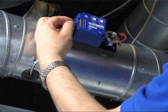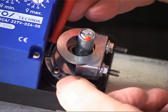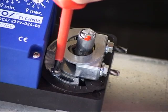When it is open — this can be identified in most units when the slot in the damper shaft is standing horizontal — the 24V must be switched off immediately. In this position, the rotation angle limiter of the Trox compact controller must be locked.